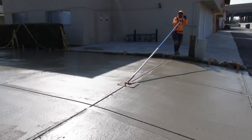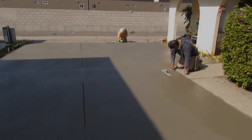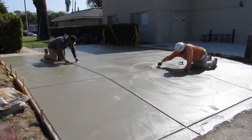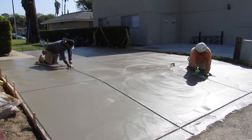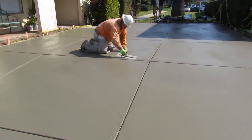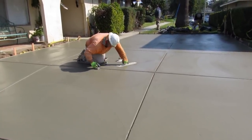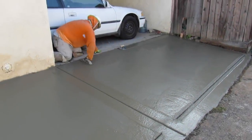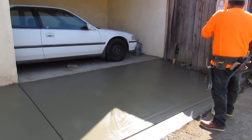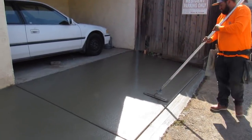The cutter puts a deeper groove in for expansion movement cracks. Always remember to joint off corners because that's a definite crack spot — on the side of a sidewalk you've got to run one both ways or it'll crack. But you never know; I've seen it crack up the middle between two joints. It helps with your law of averages of not getting a crack, but anything can happen. It has to do with soil, what sand they have, what portland they got — there are a lot of variables: the heat, the ground, how quick the water bled through and rose up to the top. This is just a basic job for me — no anxiety, no sweat, just in and out.